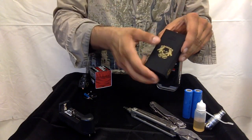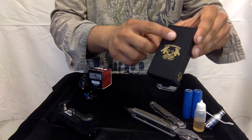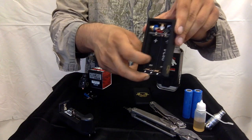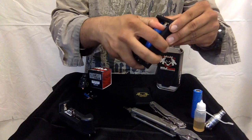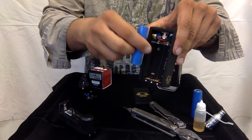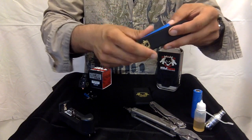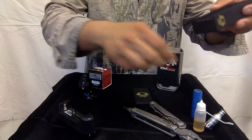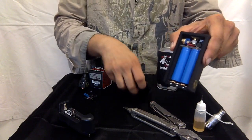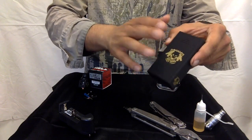When you get the mod, this is what it looks like. There's a little slider right here — you slide it off and it exposes two slots where you put your 18650 IMR batteries. When you put in the battery, make sure you check the positive and negative diagrams so you don't put the battery in backwards. After you put in your two 18650 IMR batteries, you can slide the cover back in. It is a magnetic cover so it stays on pretty snugly.